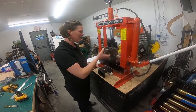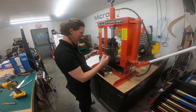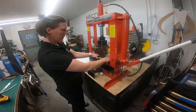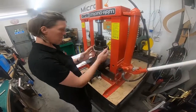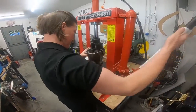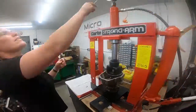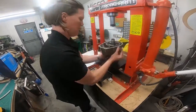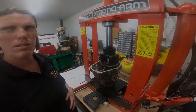I'm stripping the gearbox and taking all the components out. What we've got here is the gearbox set on a stand, so the weight's been taken on the end of the prop shaft. The idea is that we compress all the gearbox components down on the springs — the disc springs that are inside — to the point where we're able to get out the two ring halves that lock everything in place. So, that's what we're doing.